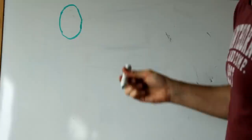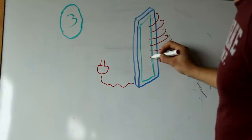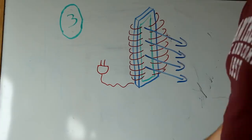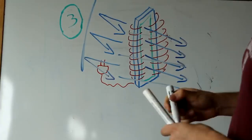There are other benefits of this dipolar radiation pattern. Since waves emitting towards the edge of the panel are cancelled sooner than those emitting from the center, because they're closer to the rear, the dispersion is very controlled. They beam more and much less information is emitted off axis and to the sides. That prevents wall reflections and it maintains a great stereo image when you're in the sweet spot. Moreover, with the correct placement, the waves emitting from the rear of the panel can reflect off of a wall, and in return, they return in phase with the waves coming from the front of the panel, and that reinforces the sound and adds depth.